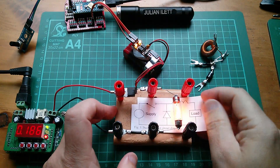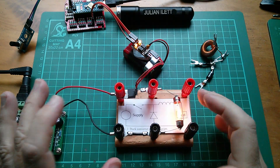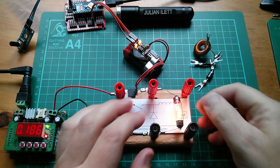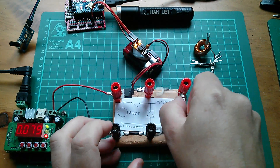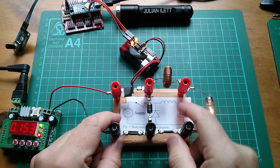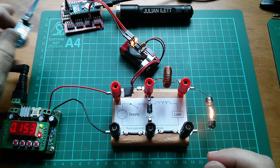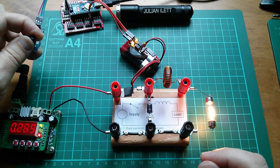However, it doesn't mean that this isn't buck converting. It just means that it works just as well without the buck converter components as with them. So I'm going to put them back, because I want to see if there's another way I can determine whether or not this buck converter circuit is actually doing a DC to DC conversion. So I've put all the components of the buck regulator back — inductor, diode — and yeah, we're still getting brightness control there.